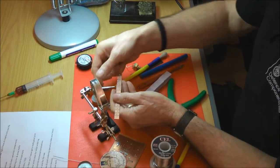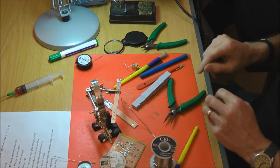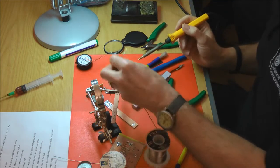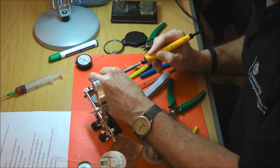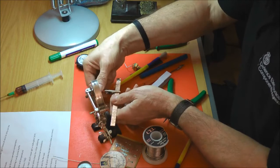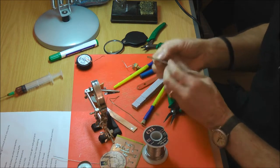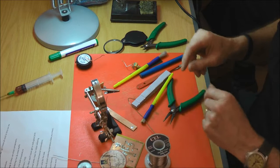Now, one of the bizarre things with the American standard, which we've been working to as an accreditation, is that's pretty well an acceptable joint. It's not one that we would leave like that. We would certainly rework it. But it's surprising, it only has to be something like 270 degrees. And again, just give that a light clean. One of the biggest things you find is actually cleaning off your joints. If you want to pass that round, that makes a real difference if you're doing any rework.